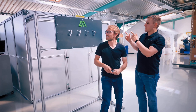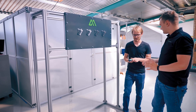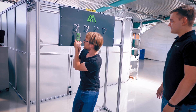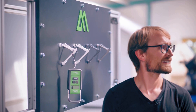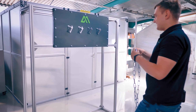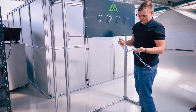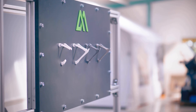Here's the test setup — let's try to break the FDM hook first using a trusty scale that goes up to 40 kilograms. We load it up: 20 kilograms, 30, 40 — and it's not breaking. We get a chain and put full weight on it — that's 90 kilograms. There was a little smoke puff visible, but the hook survived.